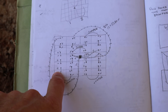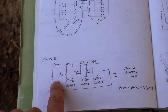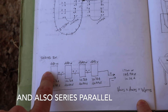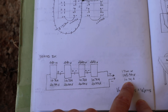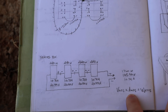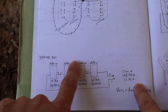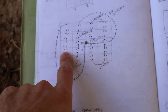Right here I made a quick sketch of the configuration of our solar array. It is four panels wide by five panels tall. Our panels are going to be wired in series, which means that we add the watts for each panel, the amps stay the same, and you add the voltage also. Using Watt's Law — watts equals amps times volts — you see all those numbers work out together. We're not going to do a string of four; we're going to do two strings of six and a string of eight.